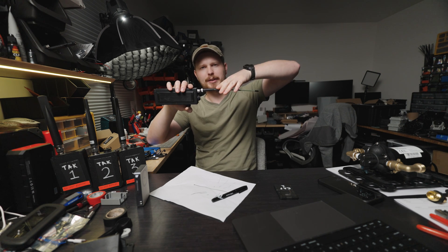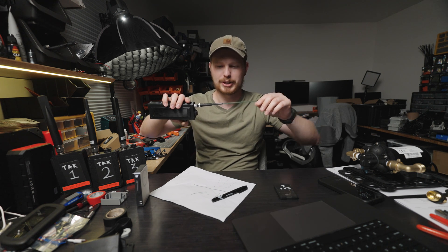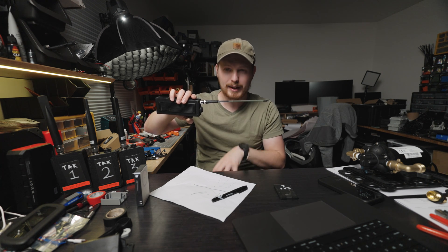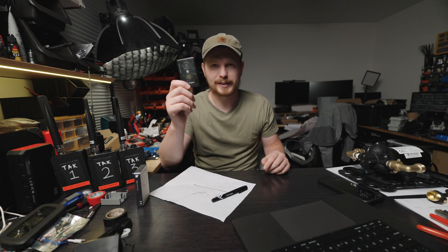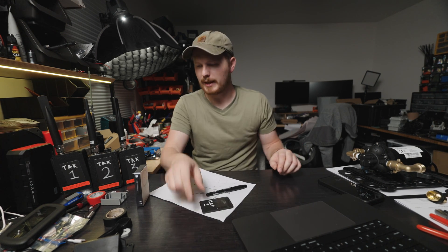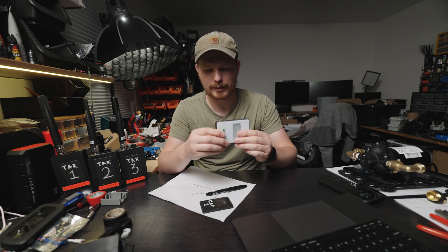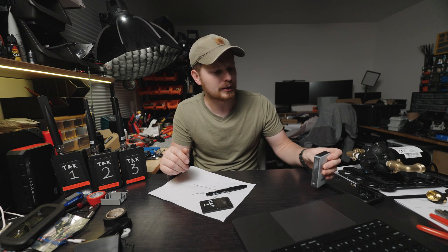By turning your antenna sideways, you're propagating your signal up and down. Everything going up is a waste — I doubt there are any aliens with Meshtastic — but everything going down is hitting those ground nodes. For example, with a SenseCAP you want to orient it like this, and same with other nodes — just point the antenna to the side and it'll propagate downward.